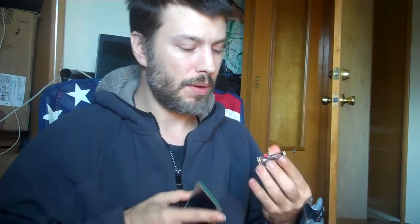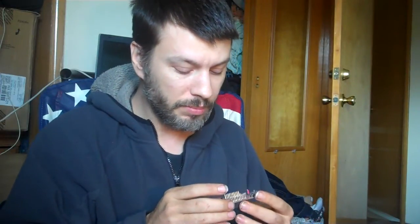If you're wondering about the control system I have planned, keep watching. Down in the links there is going to be the link for the Kentec display demo that I did. This is the Kentec display — a little touchscreen you can pick up for $35. And this is the TI Texas Instruments Stellaris Launchpad LM4F120XL 32-bit microcontroller running at 80 MHz with SPI and UART and all of those different bus protocols.